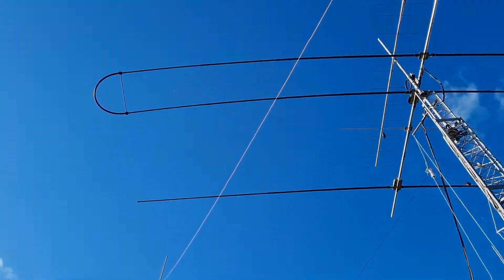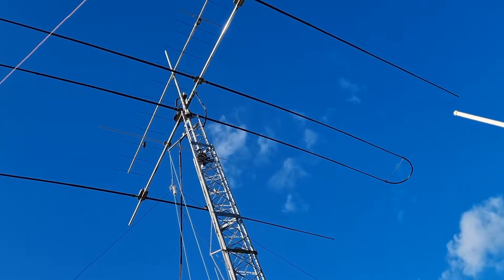You can run these horizontal - that's fine if you have problems getting things up that high, but you just won't get the DX performance that I'm getting and signals will be down a little bit. I also have at home a three element Spiderbeam, and the Spiderbeam has a 40 meter dipole - to be honest, the Spiderbeam is about 2 S-points better than the delta loop. But before I had the Spiderbeam I had the delta loop and didn't have anything else.